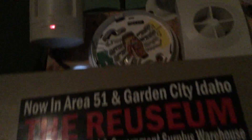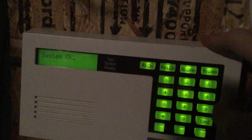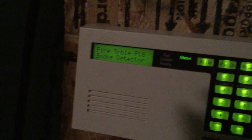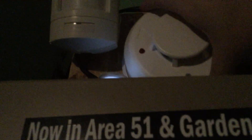That's arming and disarming. I'll show you fire trouble — so I pull the detector. We get trouble. Press command 4 to view. Command 4. Point trouble — press A to view. Enter my master code. Smoke detector — fire trouble. That is the trouble. Now let's put this detector head back up. I noticed something about this detector: the LED is still flashing even when it's not in the base, and it does that for quite a while after you take it out. There we go, back in — and back to normal status.